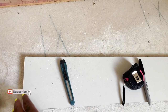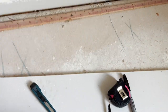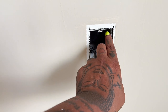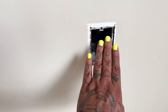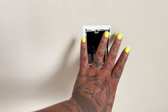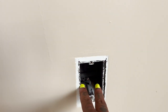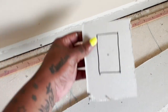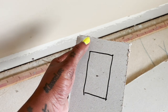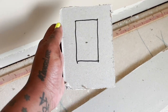I'm going to start off with just a strip of drywall. I've got my tape measure, my utility knife, and a Sharpie. I'm going to measure the width and the length of the inside and deduct about a quarter of an inch on each side so the drywall sits flush into the wall. The remaining paper around it is going to act as tape for the patch. I measured the width and length and transferred it to the back of my drywall — that's important, you want to mark the back.